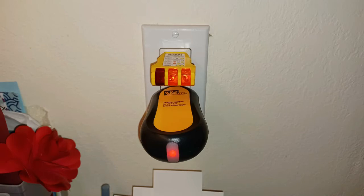In the top socket of the outlet I have plugged in a circuit tester. It's a great tool and fairly inexpensive. It shows that there is power, and the two amber lights show that it is wired correctly with respect to phase, neutral, and ground.